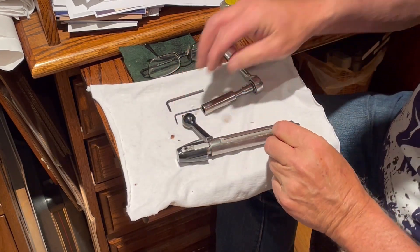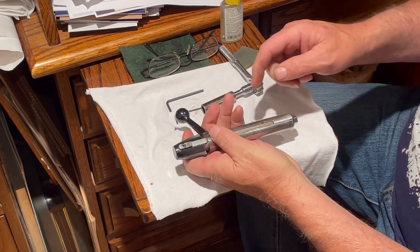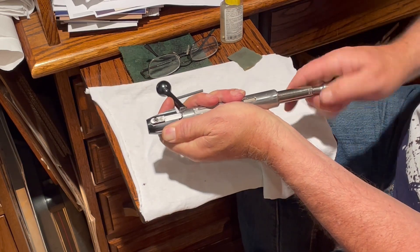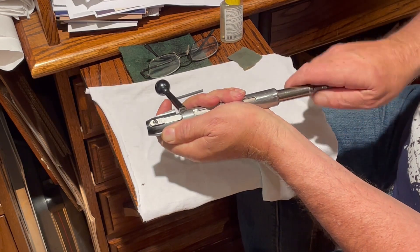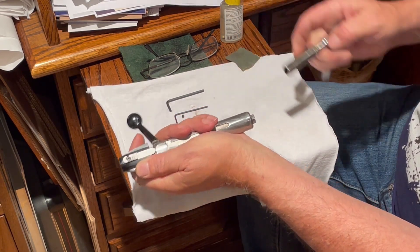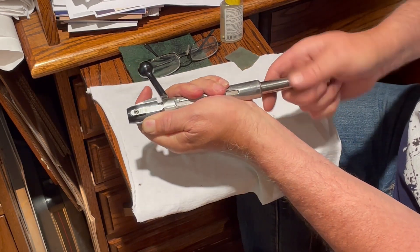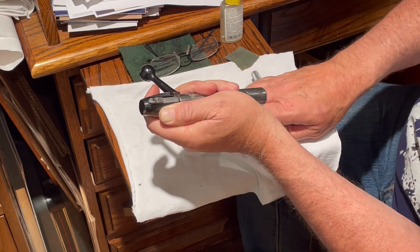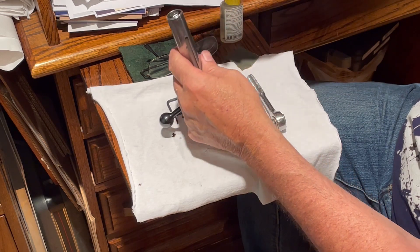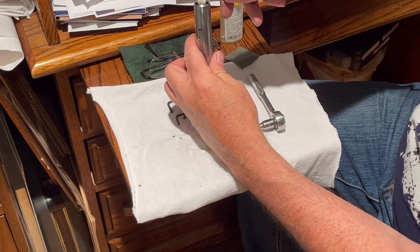So now what we're going to do is adjust the firing pin. You've got to hold this shroud and keep it from rotating back into the uncocked position. So we're going to put a little pressure on this with my thumb, and I'm going to turn this in. What you're looking for is your firing pin should be flush with the bolt here. Make sure to keep pressure on that shroud because it'll go into the uncocked position and then you'll have to re-cock it — that's a real pain. That looks pretty good. I'm going to use a straight edge here. That's right on the money.